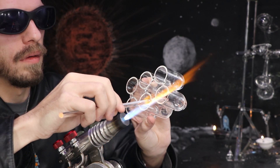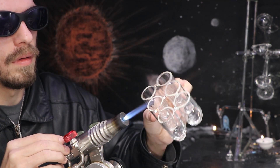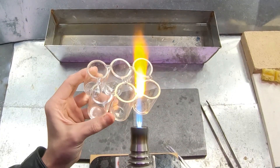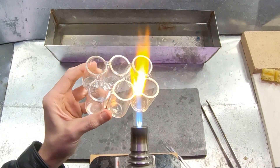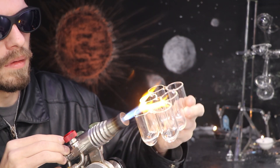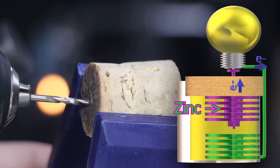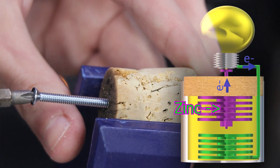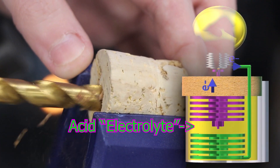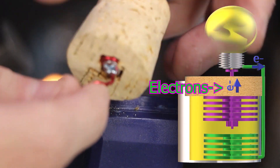I actually did test the concept out on a potato. I had my nieces over and we attempted the potato battery experiment. Using five red skin potatoes, we were able to very faintly power a low power LED. You're probably wondering how potato power works — as far as I've been understanding it, the power comes from the zinc, not the potato. The zinc will actually begin to break down into the acid of the battery, and as this happens, the zinc enters the acid while leaving behind some of its electrical charge — some electrons.